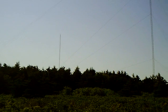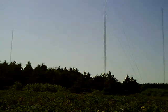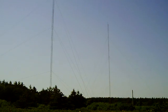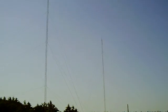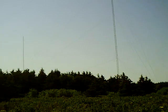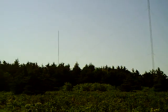The towers are about 128 feet tall, Rohn 20 with Phillystran. It's a two by two array, five-eighths wave across the front, quarter wave front to back. The front pair is phased at minus 90 degrees, the back pair at zero.